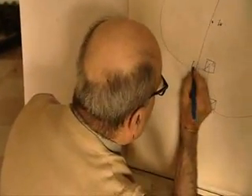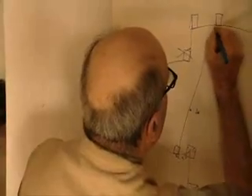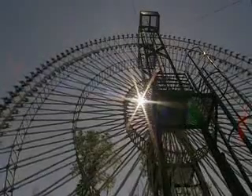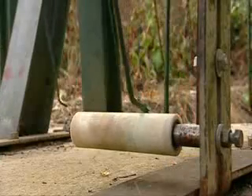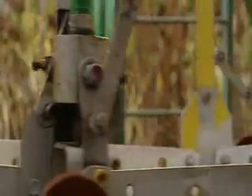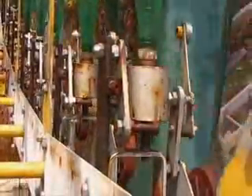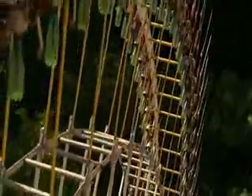As a trained mechanic and self-taught mathematician, Aldo was fully aware of the laws of physics, but he claims to have broken through the battle against friction and gravity. He explained that the wheel is always heavier on one side than the other. On the end of the spokes there are 256 movable weights. At the bottom of the wheel's arc, green levers activate individual mechanisms — each weight is pushed toward the center, contracting light springs inside green plastic covers. At the top of the arc, a similar system trips the springs, pushing the weights back to the perimeter. Thus the half moving downward is always heavier, and according to Aldo, the wheel must therefore turn forever.